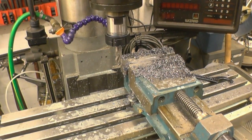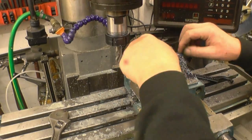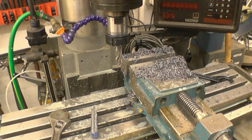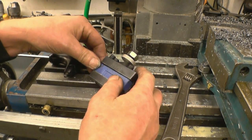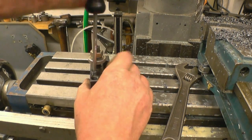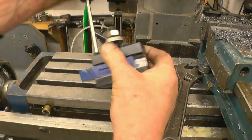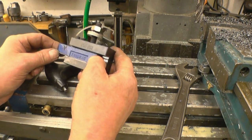That's quite reasonable. I've just done the rounding of the tool around there — put it in the lathe and see if it will be any good. Taking just enough off to get the tool in, leaving it as thick as possible to keep maximum strength in it. Right, we'll put it in the lathe tool post, set it on center height and give it a try.